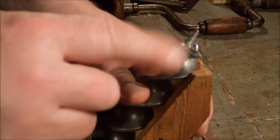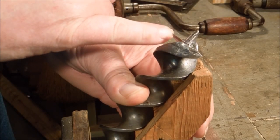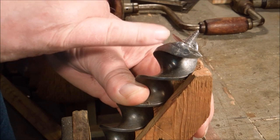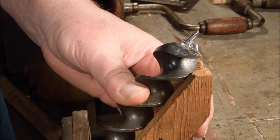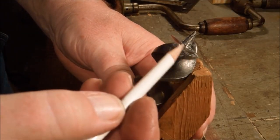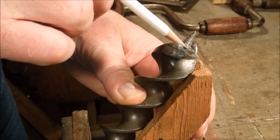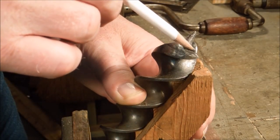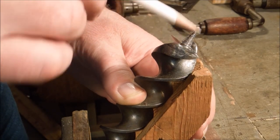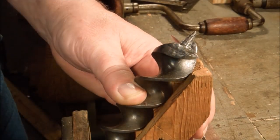If I take this spur down below that radial cutting edge, I lose the scribing effect, and this cutting edge now has to try and tear that piece of wood out. It makes a much rougher hole. If these spurs aren't sharp, if that leading edge isn't sharp so that it cuts into the wood like a knife blade, then it's going to have the same effect as if I had a piece of wood caught underneath the radial edge. It's going to tend to act like a shoe, and this ramp is just going to jack this pilot thread right out of the wood.